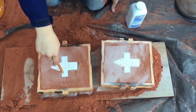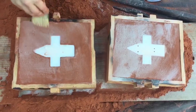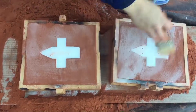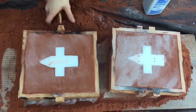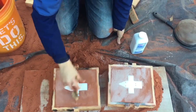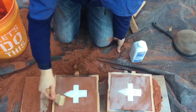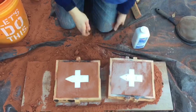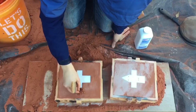These things right here, I'm using them so that I can put designs on the side of the hammer and still be able to make a hole. What I'm going to do is make a little tube of Petro Bond and stick it in here, so that the molten metal will flow around that pillar of sand, and I'll still be able to have designs on the side. It'll make more sense once I've put it in there.